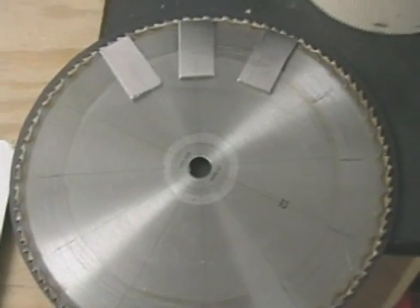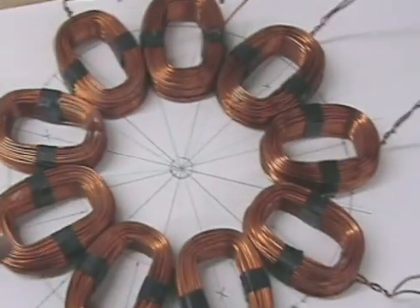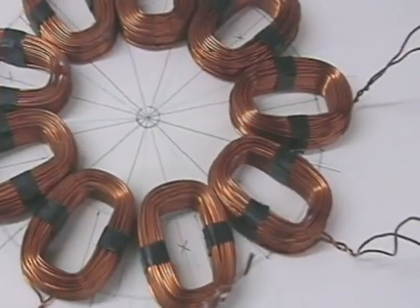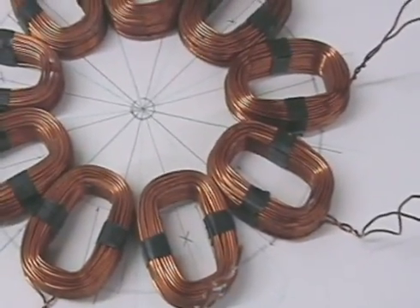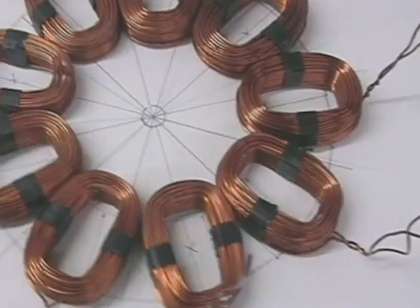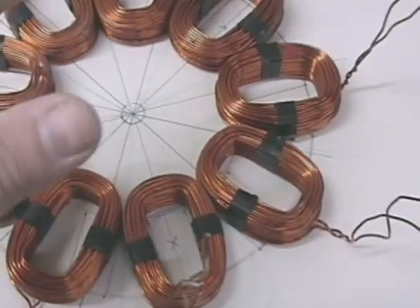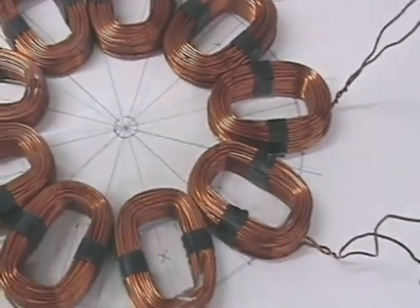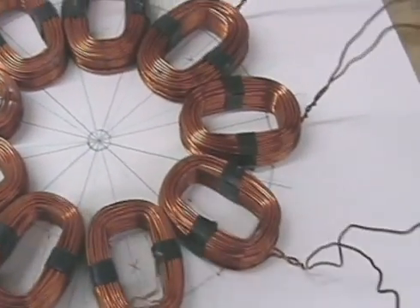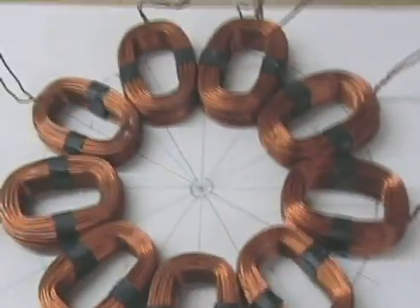This is the new generator for the carb motor. It has two plates, 12 magnets, two rotors opposing each other — it's a dual axial generator. There's no iron in between the two spinning plates that have magnets attracted to each other, so the flux is like knife blades across from one plate to the other. These are 100 wraps each and an inch thick, giving three phases — just like a home-built wind generator, because there's no iron in the middle to add drag. As the coils are energized the load will create drag, but the drag is considerably reduced with this design.